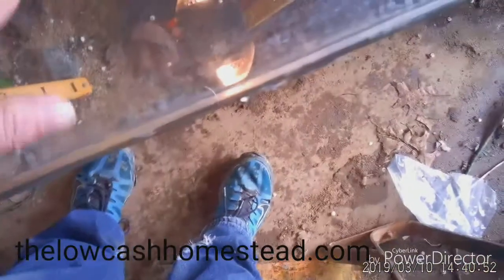We cleaned and put our second piece of glass on. You'll notice that it still looks dirty, and that is because this is the outside piece of glass. Essentially we took the IG apart and flipped it so that the mineralization was on the outside, and that way we can clean the outside panels because we've already cleaned the inside panels.